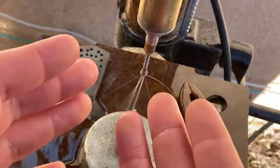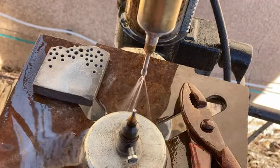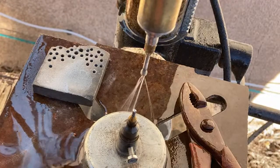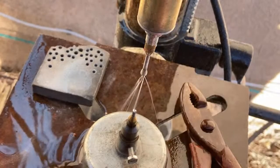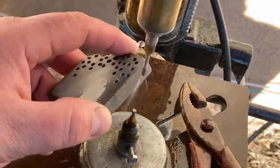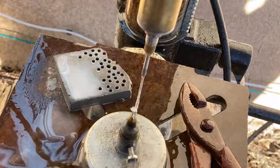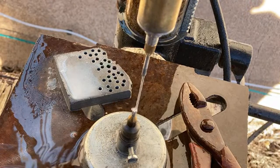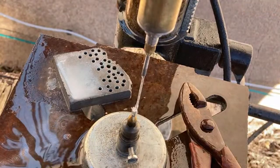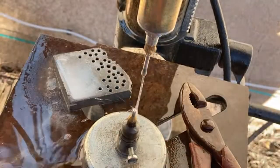When I was getting started and I was drilling stones that didn't take coring very well, I only got about 20, 30 holes per bit until I found out that this type of drilling system isn't good for every stone. In fact, I tried to drill a cheap piece of stabilized turquoise one time, and my bit exploded the very first time because it caked up. It went around the injector pin, heated up, and exploded.